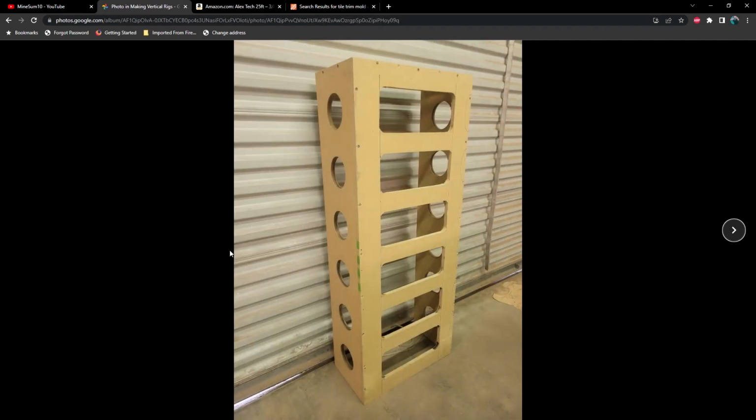And this one in particular I think is right at 48 inches tall, which was pretty tough trying to accommodate 3090s stacked vertically like this. You want enough space in between the GPUs so that you can have a platform to mount your risers to, and that's tough when you've got a large connector coming out of the top of it.